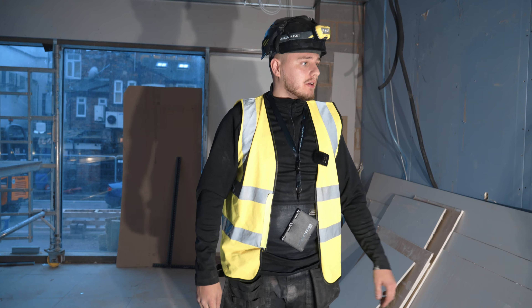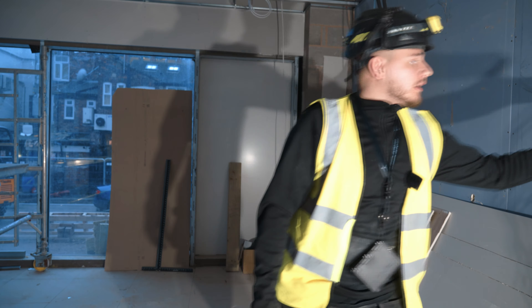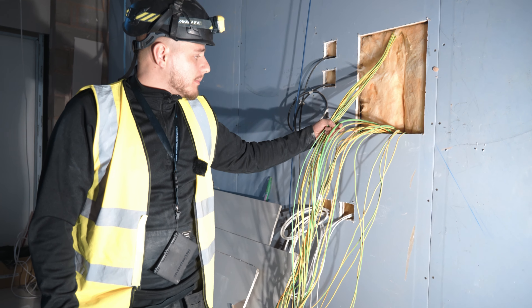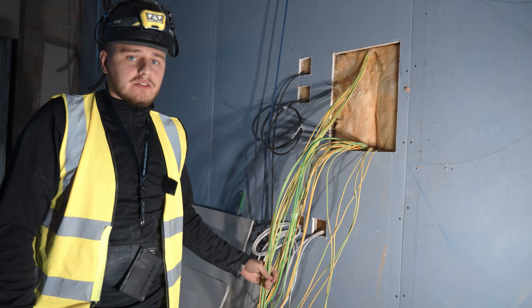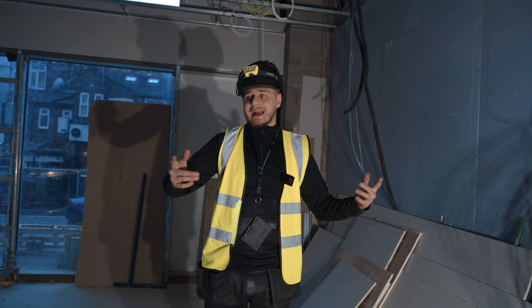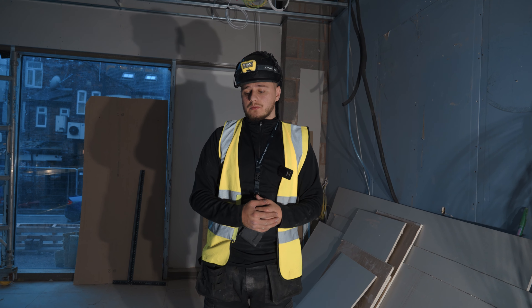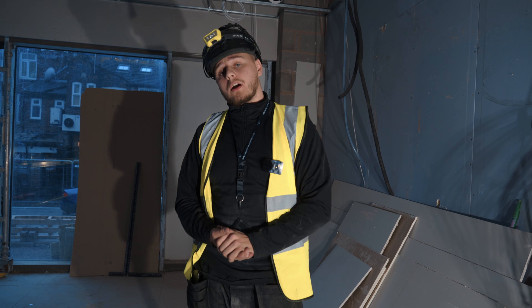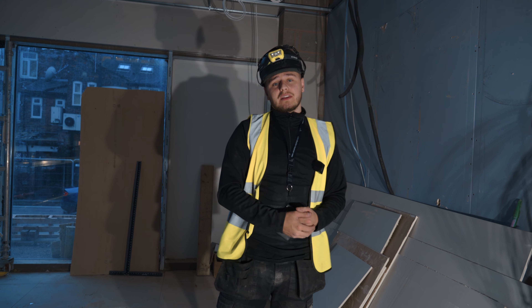So that is it for today's video. I'm actually stood in one of the surgeries, which is pretty cool. Over here we have where the EBB is going to go — the earth bonding bar. So you can see we've got a main earth coming in, a couple of big ones as well. And then every socket's got like a four or six mil earth going to it. Hopefully you found this video interesting. If you want to see more on the medical project, let me know — I should be back here next week anyway. There's a UPS system in that as well, changeover switch, which will be pretty cool. Batteries and all that. Thanks for watching — as always, if you haven't already, please like, subscribe, hit that bell button. Check out Loadout as well for any tools or equipment you need. I'll catch you on the next one.